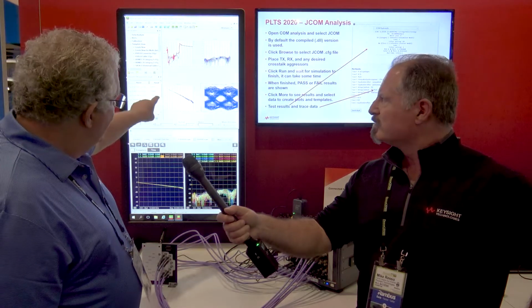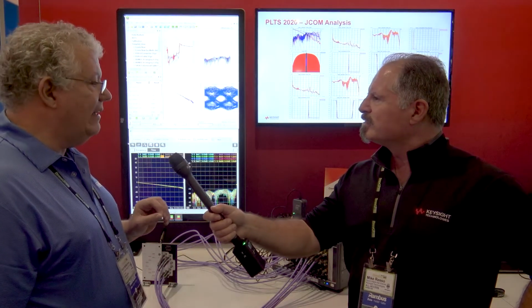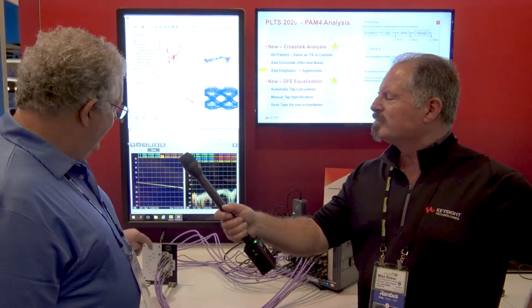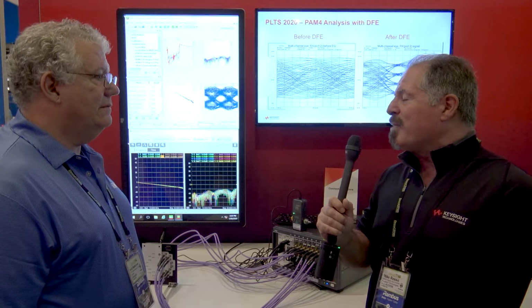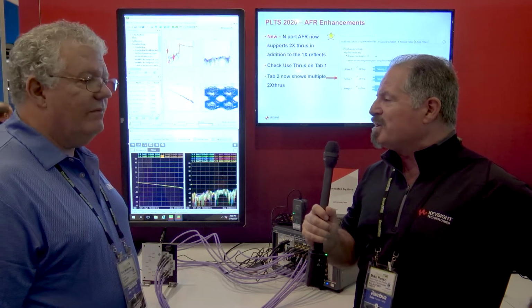And I've got to say, this kind of uniformity across multiple transmission lines in a connector is pretty much unheard of in the industry. This is actually performing better than many, many microwave connector designs that aren't even that flat. And this is including not just the connector, but also the board and the microwave vertical launch connectors. You know, Scott, that's absolutely right. At these high-speed digital data rates, all of the shortest printed circuit board traces are acting like microwave transmission lines. So you've really become quite the microwave engineering design scientist. But this is what it takes today to design these high-speed digital connectors.